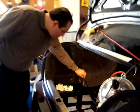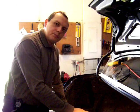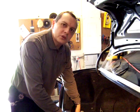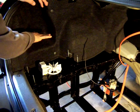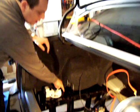I also finished the supports for the charger already, because I didn't want to be soldering while the batteries are there — the batteries are made of plastic, so any sparks from soldering can damage them. I didn't want to do any more soldering after the batteries go in. The charger is going to go here in the trunk. I thought about putting it under the car where the gas tank was, but it would get dirty. It's better to keep it in the trunk — it will only reduce a small amount of trunk space. There's even an existing hole for the charger cables — that's perfect.